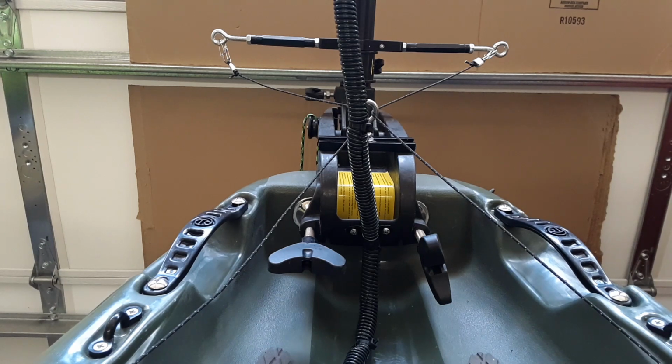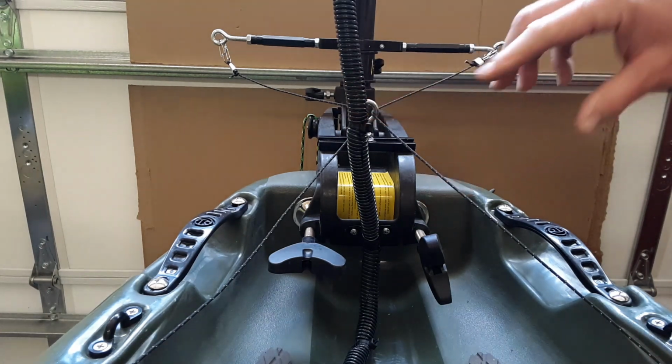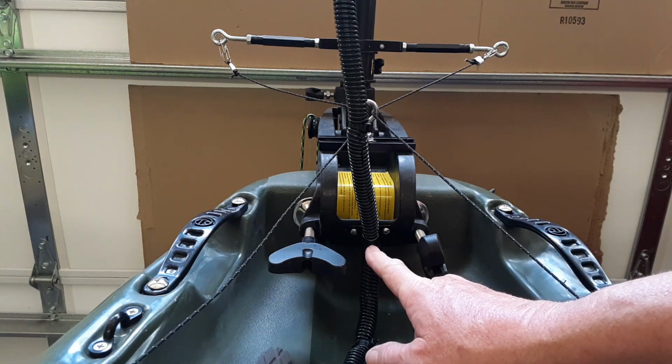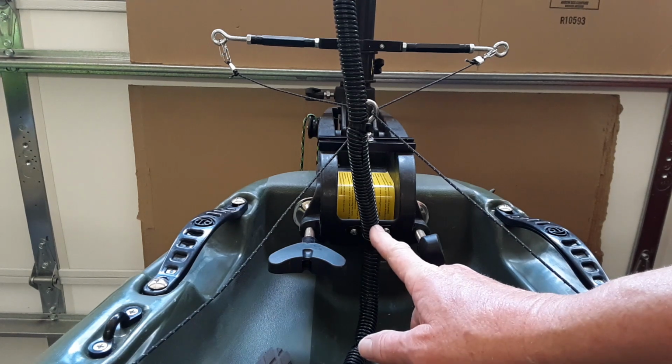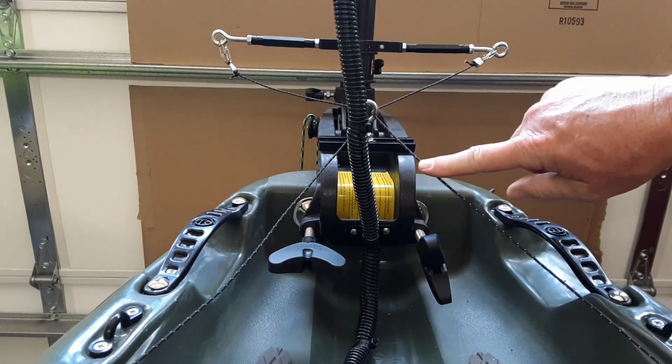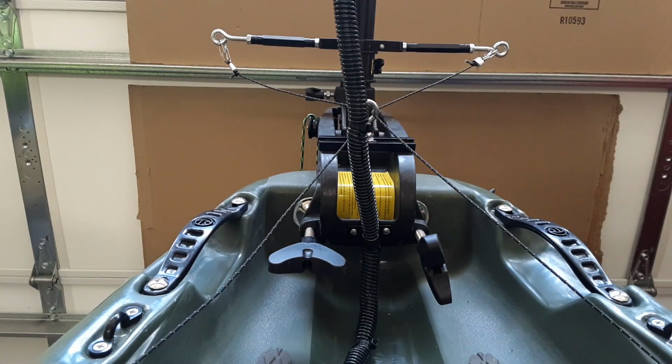Now there's another part of the design that I had to make specially for this setup. Because I'm running the wiring down the center of the mount, I needed to make sure that when you turn almost 90 degrees in either direction, that the lines here would not run into and rub against that split hose cover. So what I did was I made a loop big enough in this to make up enough room so it could turn 90 degrees in either direction, but I put a little two-hole strap right down here for 1/2 inch EMT tubing to lock this in place. So there's always going to be enough room for it to turn side to side, but it'll stay in the center so these steering lines do not interfere and rub on it.